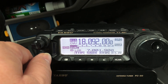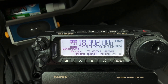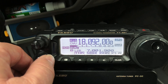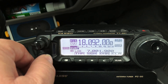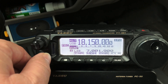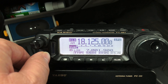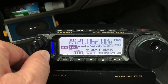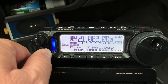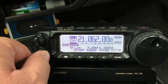Now we're at 17 meters — there's a popular CW frequency. IPO is enabled, but if I was a base station I probably would not use IPO this high up. You do need your RF amplifier. But again, narrow mode because I want the filter to start at 500 and then I can lower the width. Then there's a popular sideband USB frequency, and then there's an AM. And then here's 15 meters CW — a summits on the air frequency, popular with summits on the air. Again, IPO only because I'm mobile. If you're a base station, you're probably going to want to run that without IPO.